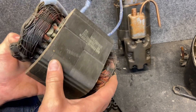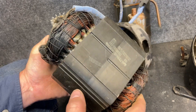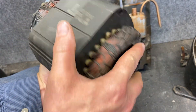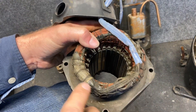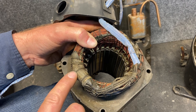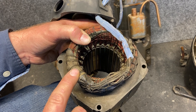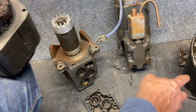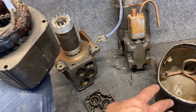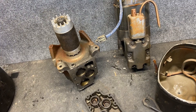This is our electrical component — a rotating electromagnetic field. This is called the stator because it's stationary, and it's a very heavy part of this motor. This is just a bunch of windings in here, but at the very top of this motor we have a little piece — this is going to be an internal thermal overload. Notice this is very far away from the outside shell of the compressor, separated by the springs. So if you try cooling this off with water, it actually takes a long time to get the heat to this component, because there's just a vapor gas of refrigerant separating the two.